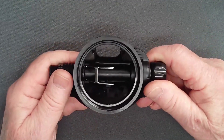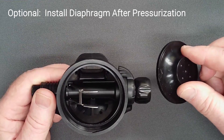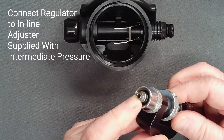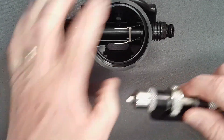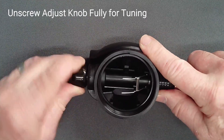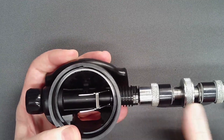The regulator is now ready for tuning. You may wish to wait to install the diaphragm until you have confirmed correct orifice position and lever height when pressurized. Connect the second stage to a tuned first stage using an inline adjuster with a hex tip. The first stage should supply an intermediate pressure of 125 to 145 psi. Ensure that the adjust knob is fully unscrewed. With the valve sealed to lung pressure from the previous step, it will nonetheless leak when IP is applied.